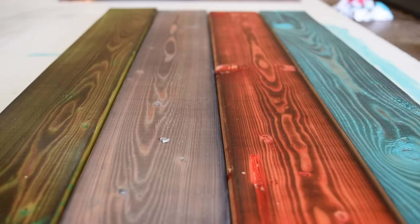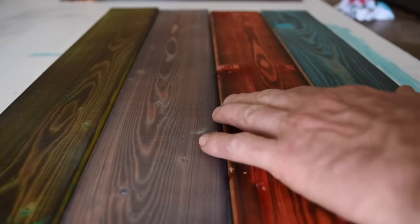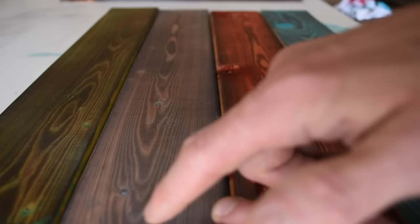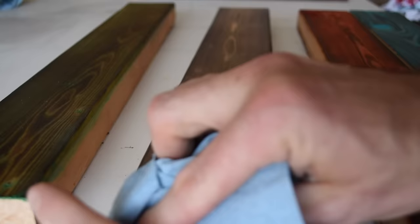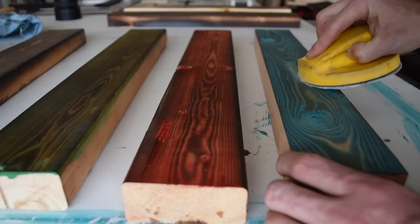Now we've given all the stains a little bit of time to dry, and I'm going to come back with a sanding pad and some 220 grit sandpaper. You don't want to use too aggressive a grit because you don't want to take off too much of the stain or too much of the char. What I'm going for here is just to bring out some more of that natural wood color. Where it didn't char, I want to pull that back out so I've got basically three levels of color going on — the gray or silver, the charred, and the natural wood grain. Just hit it lightly in the spots where you want to pull it back out. It doesn't take much to give it some contrast, then wipe off the excess with a paper towel.